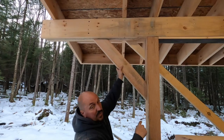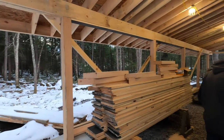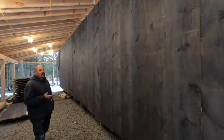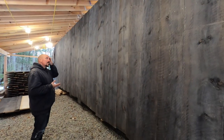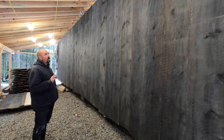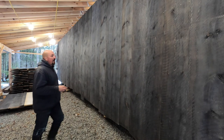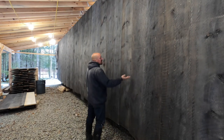On this back side we've started the installation of the siding. All of this is circle-mill-cut, true one-inch dimensional siding. A lot of it is 14 inches wide or bigger, with a couple of 12-inch pieces in the back. The siding is nailed with stainless steel ring shank fasteners, again every row 16 inches on center across the entire way.